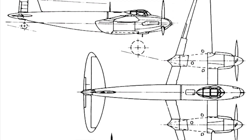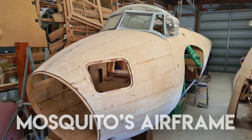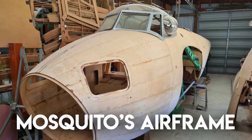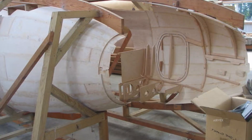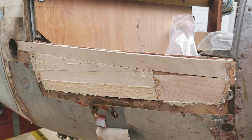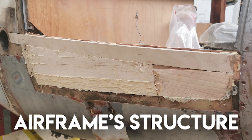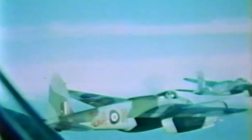But how exactly was the Mosquito airframe built? Constructed with laminated birch plywood and balsa cores, the wooden de Havilland Mosquito's airframe was a masterclass in composite load distribution. Its fuselage comprised a sandwich of outer plywood skins, bonded with aerolite adhesive around a lightweight balsa core, reinforced by internal bulkheads and brass screws, yielding exceptional stiffness while reducing empty weight to roughly 14,300 pounds.